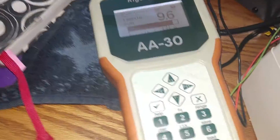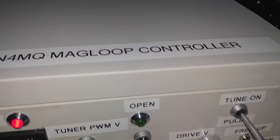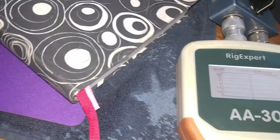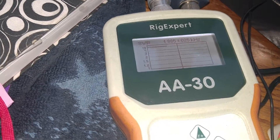If you take a look at my antenna analyzer over here, you can see that my SWR is up around 9.8. I know I need to lower the frequency, so what I do is I switch the control down to lower frequency and then I just drive the control.